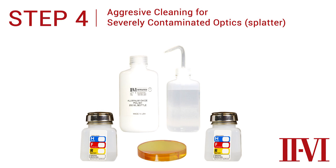This final cleaning step is only used for severely contaminated used optics and should never be used on new or unused optics. In many cases, for carbon or hydrocarbon contamination, environmental dirt, or oils, the previous cleaning steps are very successful at removing most but not all contamination. Metal splatter that is burned into the coating will not be able to be removed with any cleaning method. If contamination has not been removed at this point, we will use aluminum polish to clean the surface. This step is only to be used on severely contaminated optics — never use this on a new optic. This is an abrasive cleaning, as opposed to the solvent cleaning in the previous steps, and this type of cleaning can and will eventually remove the coating.